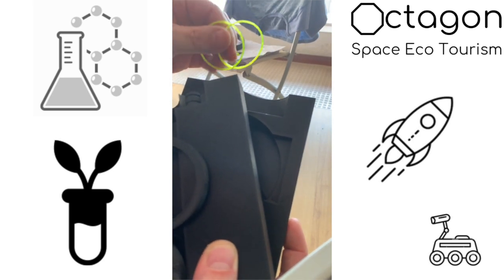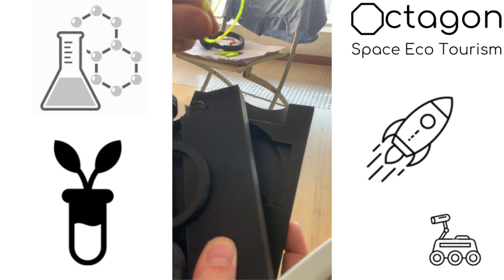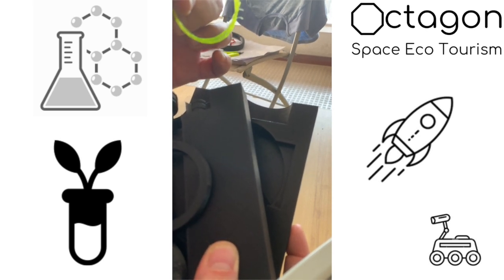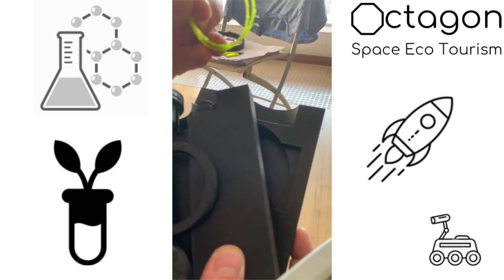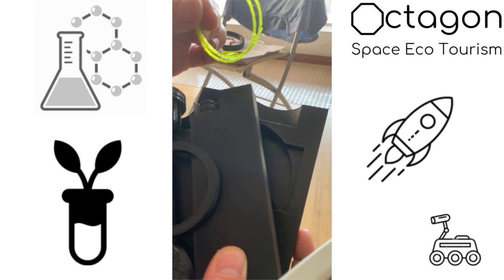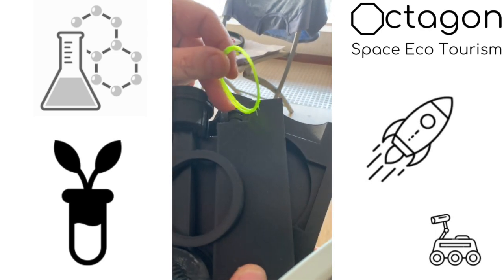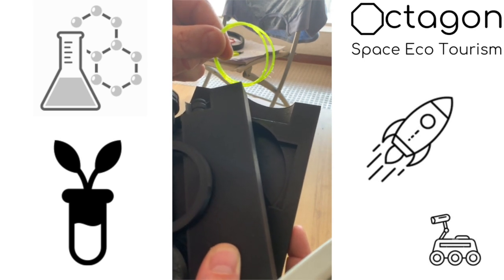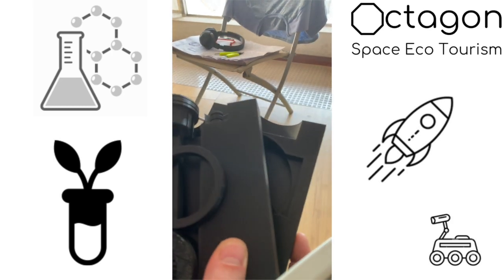and basically 0.8 and 0.8, so I'm compressing this thing by 0.2 millimeters. I'm going to keep the tolerance fixed, and like I said, I'm going to play with the stretch of these things. I'm going to keep it at 2 millimeters in diameter, 1 millimeter in radius, and as I make this diameter smaller and I have to stretch it across this or across that, I'm expecting the outer diameter of this to be smaller and the tolerance to go down. Anyways, play around with that until we're successful.